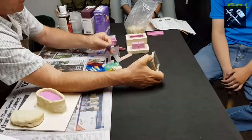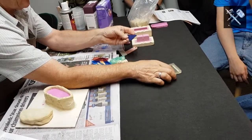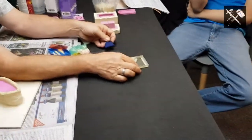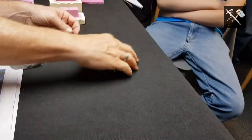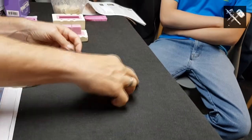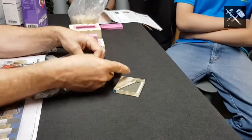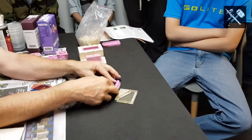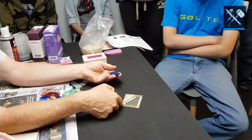Alright, the back of this piece of railway bridge is dead flat, so we don't need to make a 2-piece mould. So that's why I can stick it down into my mould box, pour my silicon into that, and then once it's cured, I pull it out, and that's where the name one-piece open-face mould comes from. So when we pour our resin in, it's just a flat back on it, and that's our finished product when it comes out of the mould.